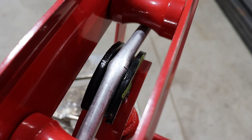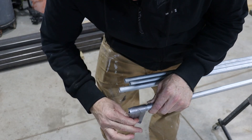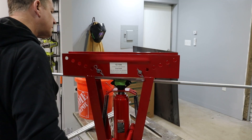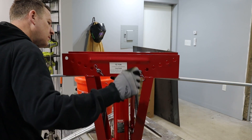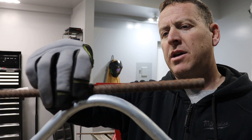Because the conduit's hollow, I kind of expected this, so I did buy a bag of sand that I'll fill this conduit with, and hopefully that'll help. The sand and conduit still had the same result, but what I tried instead was using a piece of rebar — I put the rebar inside the conduit, got it centered between the two wheels, and it bent a pretty good 90.